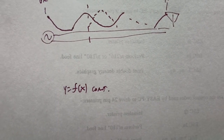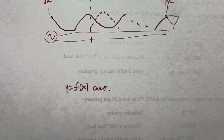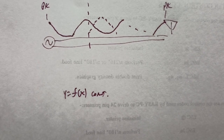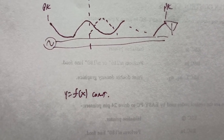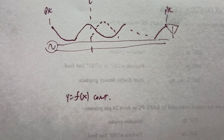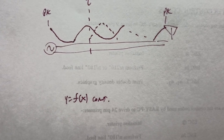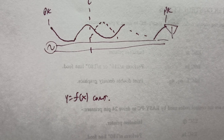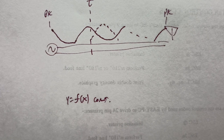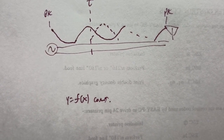But the observation that makes this simple is that when the feed point is correct, there is no reflected energy. So there will be no reflected current. Well, that's never the case. And that's related to the factor called return loss. You'll probably see that on an analyzer, return loss of 23 dB or 35 dB. That return loss implies how much energy is coming back to the transmitter. At 30 dB, that's 1,000 times less, so it's trivial. A return loss of 9 dB is not good.